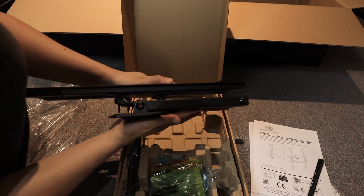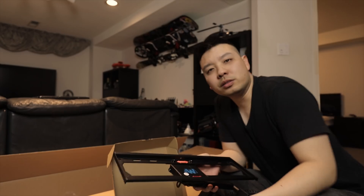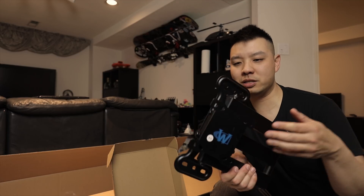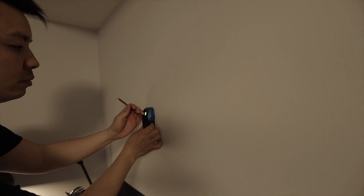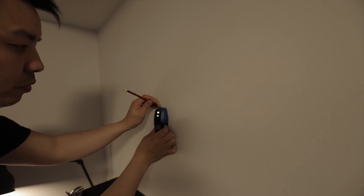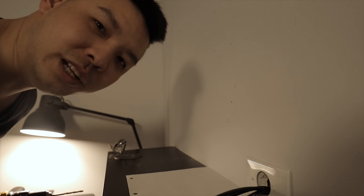It's pretty flat, so you can have the monitor sit pretty close to the wall. With the VESA mount being 100x100, we actually don't need the extra plate. Before we bolt the monitor on, let's put this onto the wall, make sure it's level and straight. Get yourself a stud finder and find the 2x4, because you can't mount this onto drywall only. Before you start drilling, use a piece of paper underneath so you don't have to do as much cleanup after.